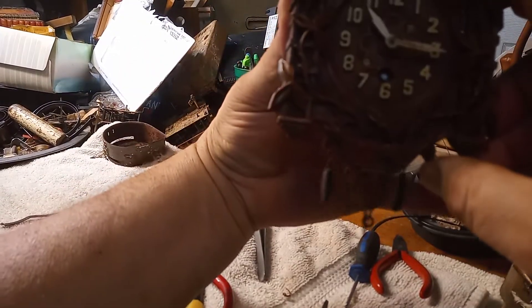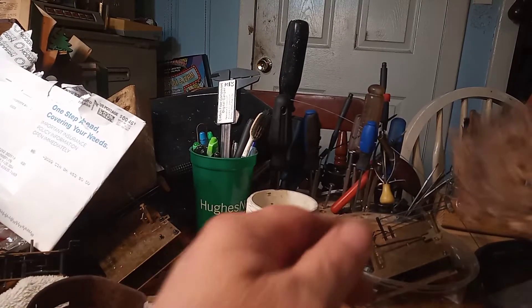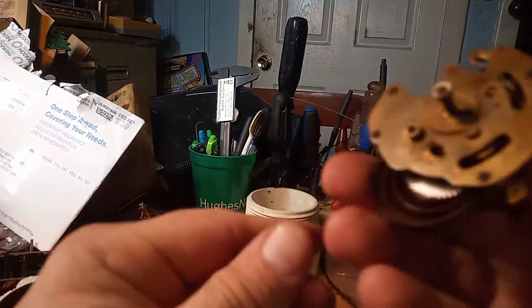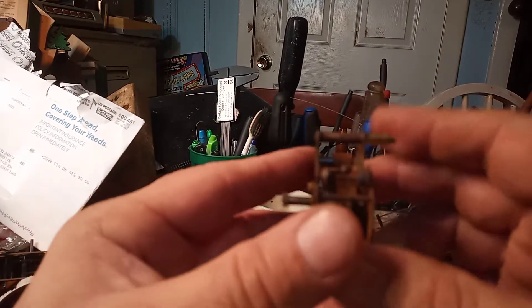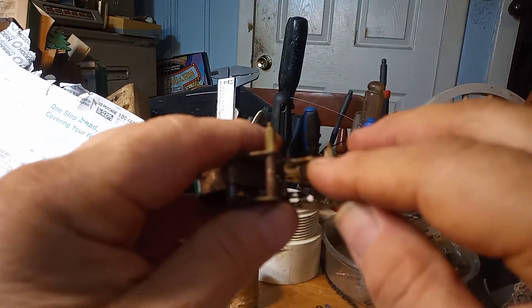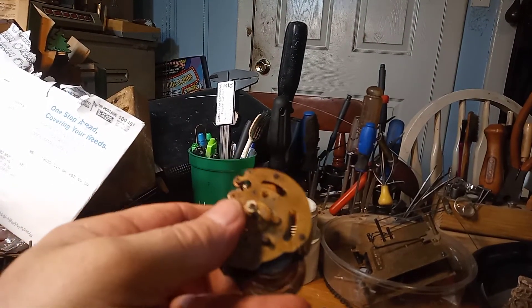Here I have it so it's not touching the front or the back of the case, so friction will not stop it. This clock is ready to be hung on the wall. I hope y'all like this video — please hit the subscribe button. By the way, I did take the movement out of the other clock. Here's the movement — it's nice and rusty, the spring is rusty, it's going to need cleaned up. A friend of mine gave me a Luxe clock with one bent arbor on one of the gears, so I could always use this as a parts clock. Again, I hope y'all like this video — please hit the subscribe button and God bless.